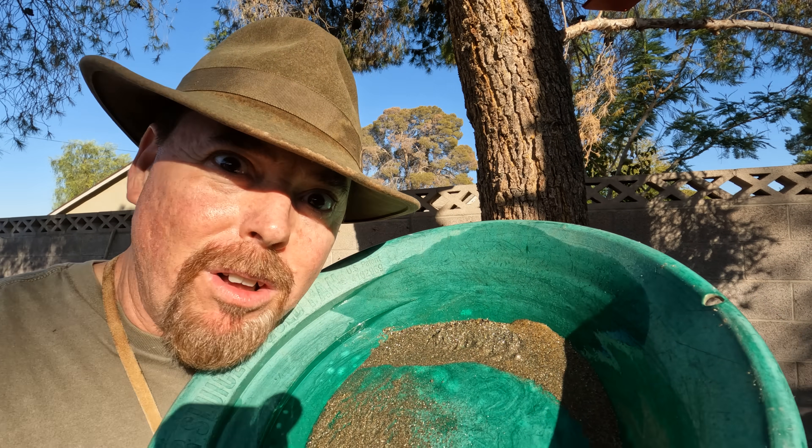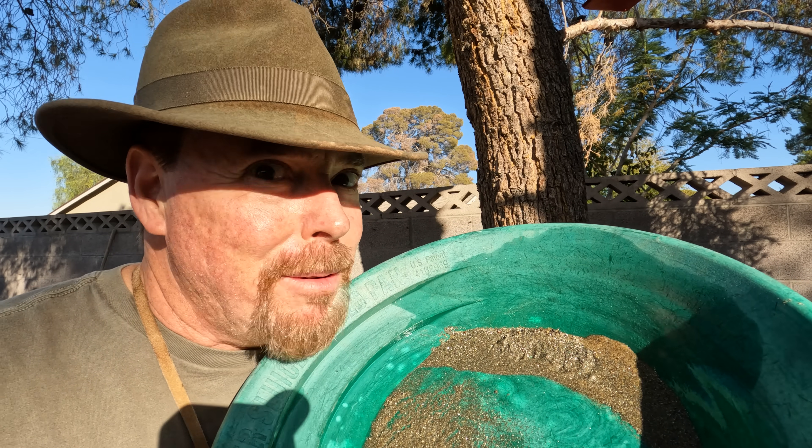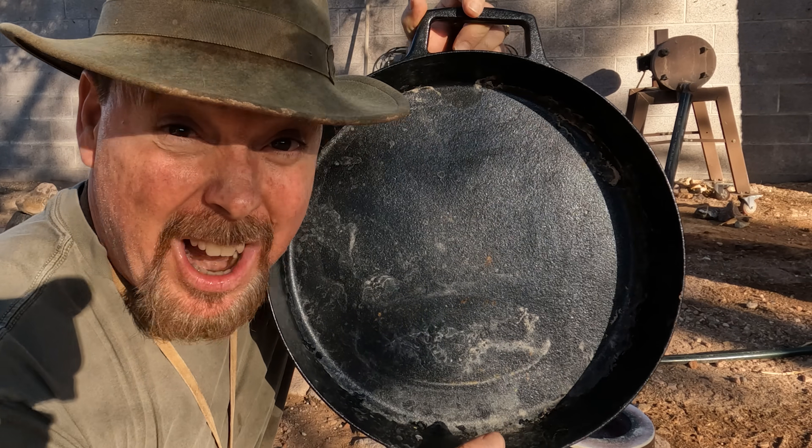It's not magnetic at all right now because it's got too much sulfur in there. But once I roast it and get rid of that sulfur it's going to be really magnetic. On a side note, I found more gold in arsenopyrite than in run-of-the-mill pyrite, because gold has an affinity for bismuth, antimony, and arsenic. When you go out looking for this stuff in your USGS reports, look to see if those other elements are combined with it — because if they are, you're on a winner. When you roast it, you want to get it up to about 1,000 degrees. If you use a common gold pan it might burn through, so use cast iron if you can.